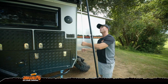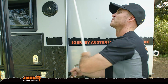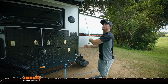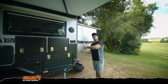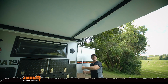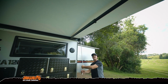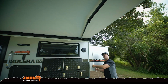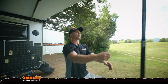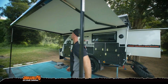So we do that, we're simply winding out. Now as we get to our full extension, what we want to do is keep an eye on the vinyl. We'll see our arms overextend and the vinyl go floppy. We want to wind back, we'll feel it getting tight here. And we just watch the legs once they just kick back in. That's our perfect length for our anti-flap kit. So what we can do then is lower it down so we're working at head height.